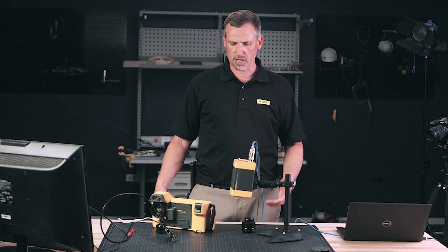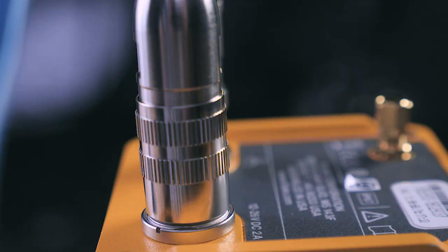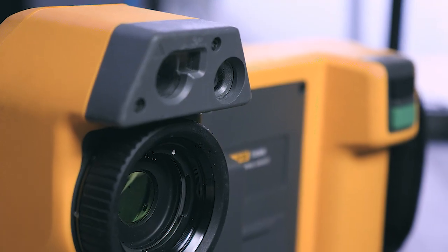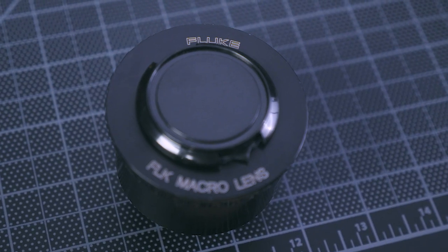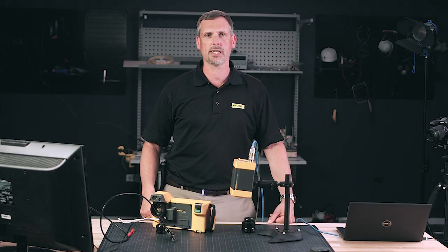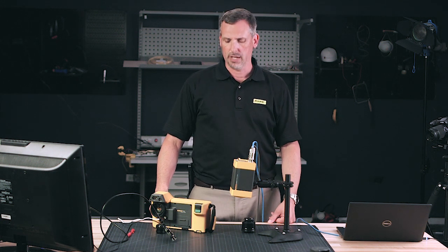In conclusion, talking about some of the things we're able to do today in the R&D world that we weren't able to do just five years ago: the ability to ensure accuracy of measurements is much more simplified with the technology. The innovation of laser sharp autofocus — being able to focus to the distance based on the distance meter built into the camera — ensures the highest accuracy possible for these applications. The ability to use multi-sharp, taking up to 60 images at a time and compressing them into one application shot, saves a lot of time and effort from an R&D or PCB perspective. Thanks for watching, and hopefully you learned something today.